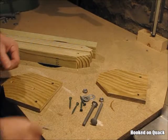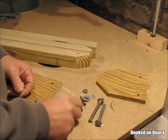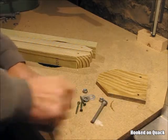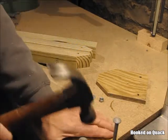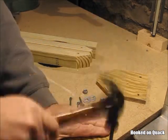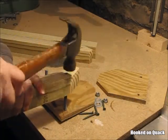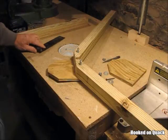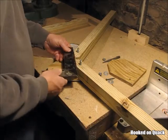I think I'm ready for some assembly. I'm not using stainless hardware — I chose to use galvanized, so I'm using galvanized carriage bolts and green galvanized deck screws. With the two outside arms semi-assembled, I'm going to open them up to their fully open position.